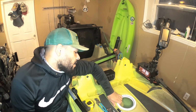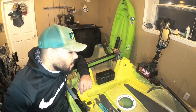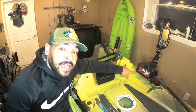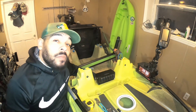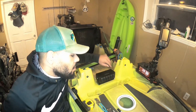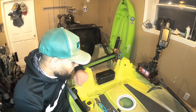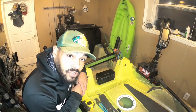At this point, what's coming up next in terms of boat mods and the Naval Yard series is, you guessed it, more holes in the boat. So we're gonna go ahead and cut out holes for the marine grade wiring coming from the battery, and then holes behind the panel switch to lead up into the panel switch itself. Again, I do have to order a couple more items, including marine sealant, and I have to take a trip out to Home Depot and get the proper hardware to finish installing the hatch. So just a couple more days of gathering and waiting on stuff in the mail, and I'll have another boat mod episode coming for you.